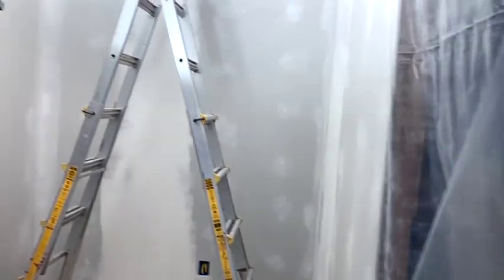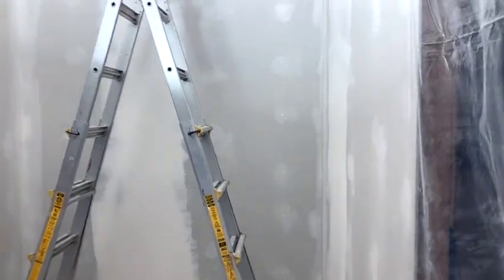Look at, I got all my beautiful wood there covered up right now so we don't splatter stuff on it. I got a little bit more of the pre-filling done on the ceiling in the joints, and I gotta remember that window's open. I don't wanna leave that open all night, but there's some pretty heavy fumes in here right now because I was putting some primer on. So in the big bathroom here, it's a little dark, but I have all the walls completely textured, ceilings textured, and now I just need to finish priming that. So we had to get some more primer.